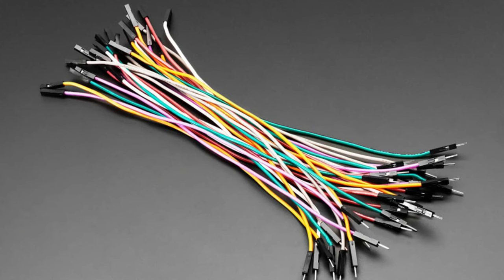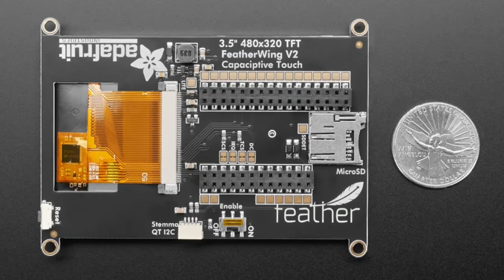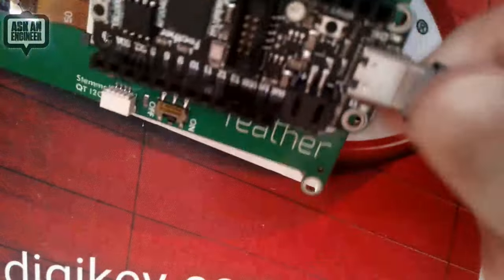This is a new Feather Wing — by request, and also I thought it would be a fun build. It's a capacitive touch 3.5-inch diagonal Feather Wing with lots of pixels. This is basically the biggest display you can get with the SPI interface. I misspelled 'capacitive' — I was working on this really late at night — I'll fix that in the next board revision. You can order now and get the version with the typo, which might be worth more in the future like a misprint on a stamp.